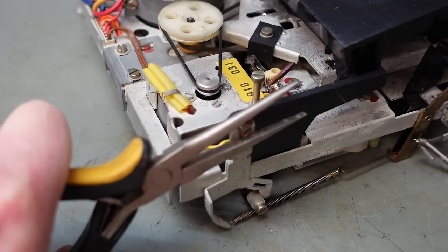Now forced down the road of the obscure parts. These are sort of clock repair bushes. These will all be imperial, so there won't be any 2 millimetre ones, but something close, maybe. Yeah, this one doesn't quite go over the shaft. Try another size. Now this one. Oh, that's a bit of a rattly fit, that is. Measures 2.3 mil. Yeah, too big.